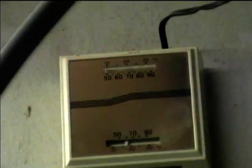I still have it. I'm going to salvage the motor and fan from it. But we got this in 2005. And it has a constant standing pilot and a 24 volt gas valve connected with a flexible supply tube up here. Here's the gas valve, and it's just connected to the thermostat here.